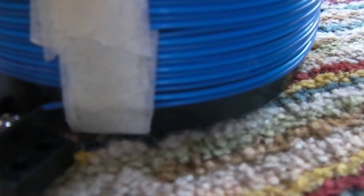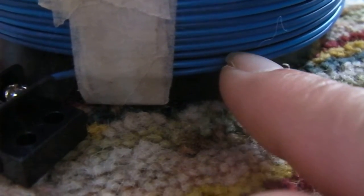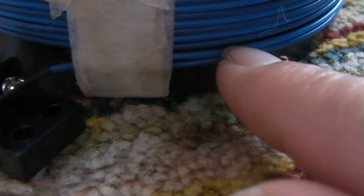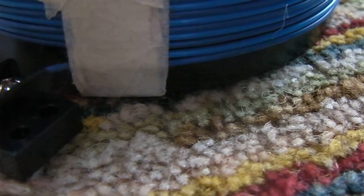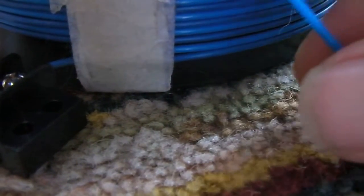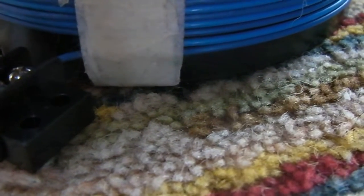The secondary is wrapped with 20 AWG wire, and in between I have this plastic trimmer line to space it out and reduce the capacitance of the secondary.